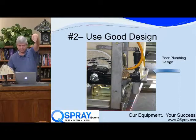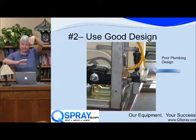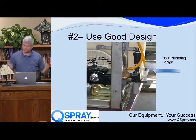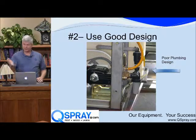So you don't need a shutoff because it's not going to drain out, okay? And then you have agitation at the bottom of the tank, and you can put a shutoff valve in agitation because you still have pressure relief in the top. It's a little technical, but it's really important. And I want to, can I get anyone following what I'm saying here? This is stuff people don't look at, okay?